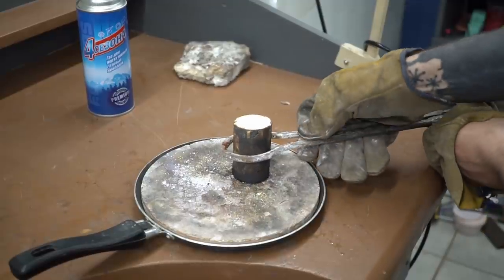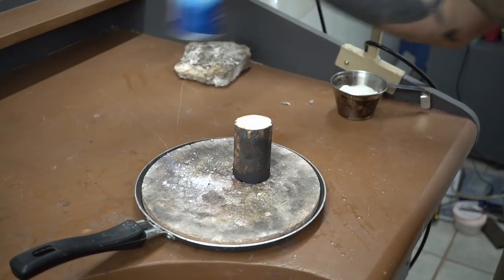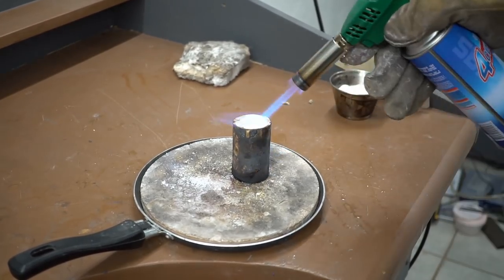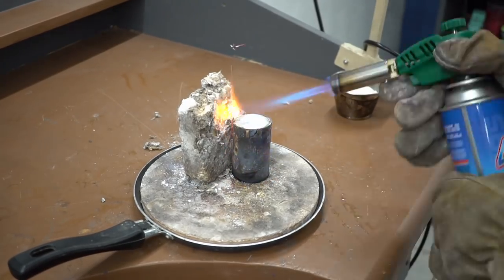If the substance is too stiff, there is a chance that it will not close tightly and steam will seep through the cracks. If the substance is too wet, water will squeeze out when pressed and fall on the metal, which will immediately solidify before being poured into the mold.